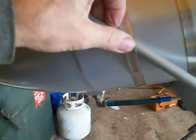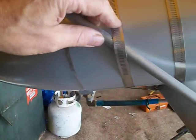On the back, when we have an angled jury strut to work with, you've seen we've just put another larger hose clamp, and there's no interference there. There's no sign of any wear or anything. And we have the primary one here that's locked in at the bottom of the rear lift strut right there. So the front and the back are basically the same for that.